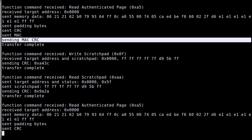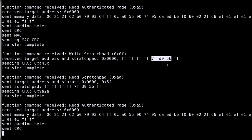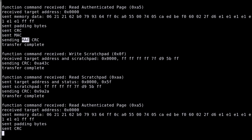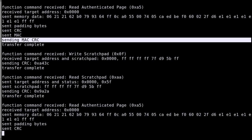The problem with that is that the chip makers are also not that stupid. This is why you're writing a challenge. So the challenge is individual and it is input into the MAC calculation. So the printer uses almost every time a random new challenge. Sometimes it is repeating, but this is very infrequent. And since this challenge is used in the calculation of the MAC, you would need one MAC per page.